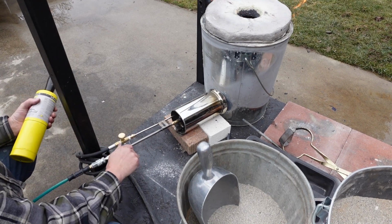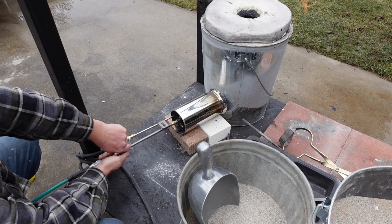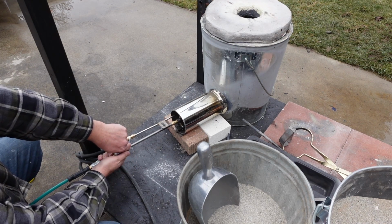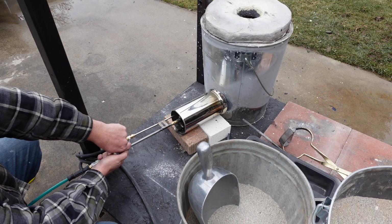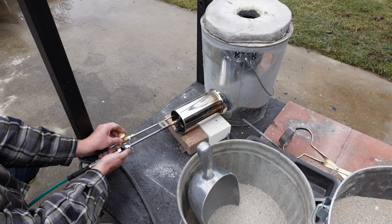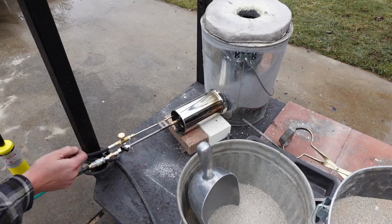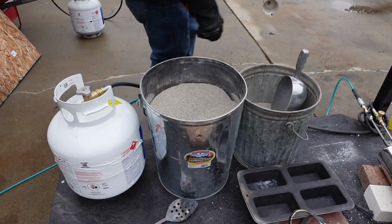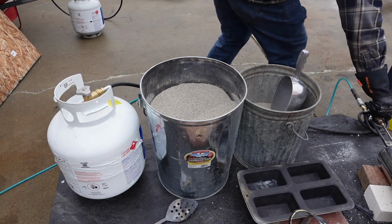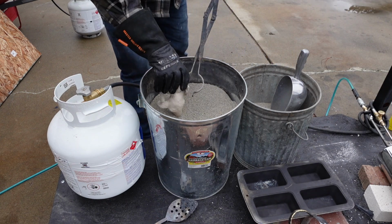So, starting up our foundry. This is just a garbage can that I've converted into a foundry, lined with kaowool and then a refractory cement over that. And this burner, I'll leave a link in the description for this burner. NoBox7 on YouTube is the guy that I got this burner from. It's awesome. It'll melt cast iron with propane, which is an amazing thing.